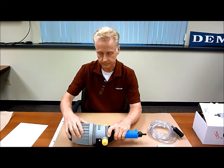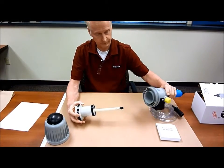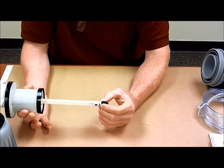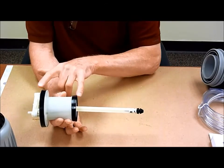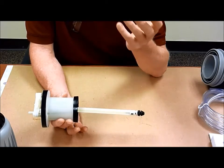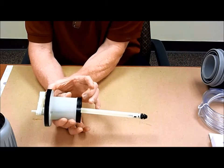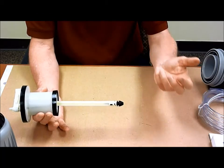So we're going to take it apart. I'm pulling the engine out, setting the body off to the side. In the introduction we talked about the fact that this is your engine assembly, these are your lip seals, and this is your chemical piston seal. These are wear items — kind of like brake pads on a car — and over time you need to replace them. As these wear, it loses its ability to be proportional. So you've had it at 1% for years and years, but you notice that it is no longer emptying the pail as quickly as it used to. That is a symptom of these seals wearing and this lip seal wearing and no longer pulling a tight vacuum and lifting the chemical up.